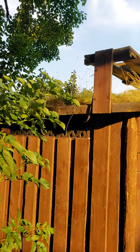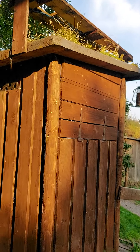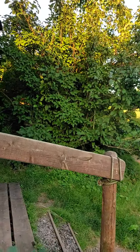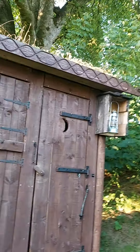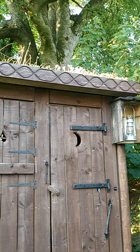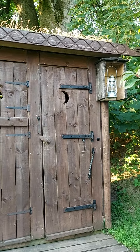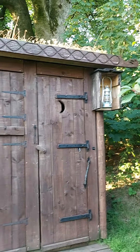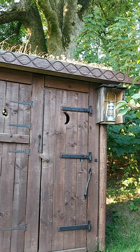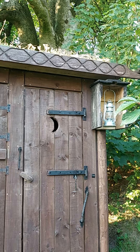My second attempt was the toilet block — a much flatter roof. I only used about an inch of topsoil and then combine mats which have grass seed already impregnated into them. They were quite cheap, so I rolled those mats out and sandwiched them between about an inch and a half of soil. It's okay but dries out very quickly. This shed can't take a lot of weight, so I've also used sedum, and the sedum is doing phenomenally well. So if you've got a structure that can't support a big depth of soil, sedum is the perfect plant — it's just growing and flowering and looks incredibly beautiful.